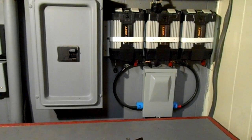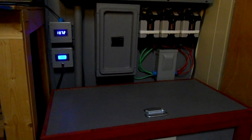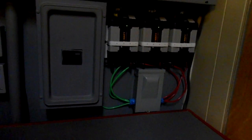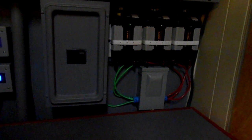You can see I've got some 2-gauge wire going up to that inverter in the center, and the other two on the ends aren't hooked up. I'm going to open up this disconnect box and get those hooked up. And just like that, it's rewired. What I've done is rewired all three of these inverters with their own set of wires using 8-gauge heavy strand wire.